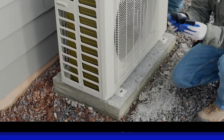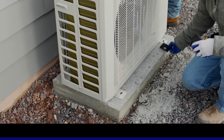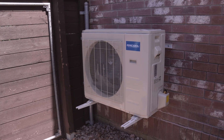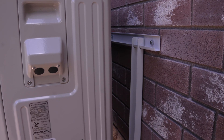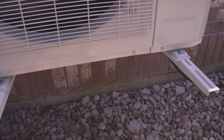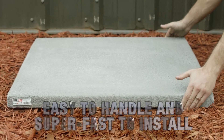There are three generally practiced methods for mounting the compressor unit. Probably the most preferable is fixing it to a concrete pad. I opted to try the bracket method — the bracket has the advantage of raising the unit up and away from dirt, debris, and snow accumulation, and may be desirable for upper-story installations. The other option is to fix it to a PVC pad that just lies on the ground, but this is by far the least secure, and frankly, I don't recommend this method at all.